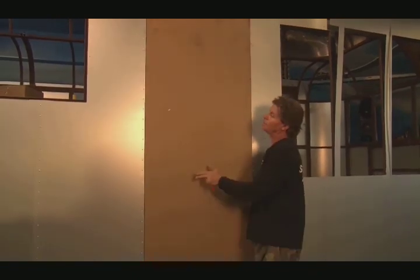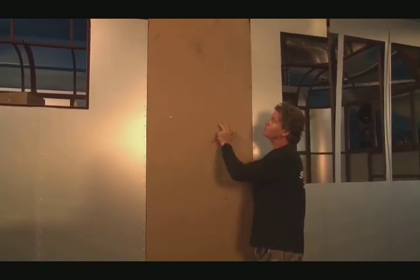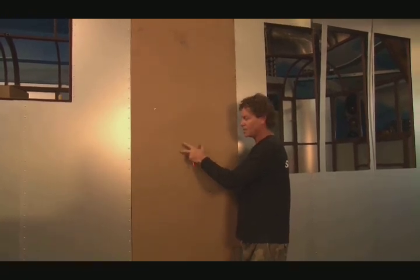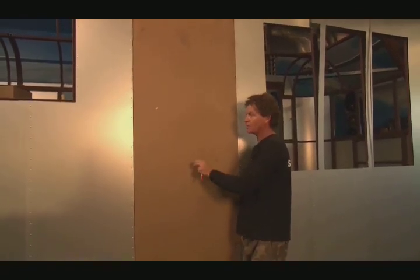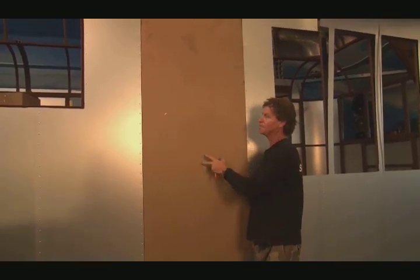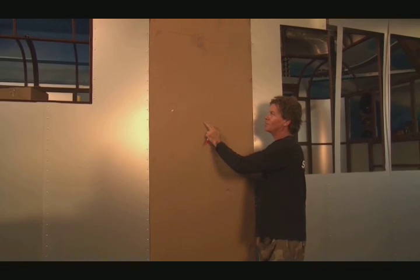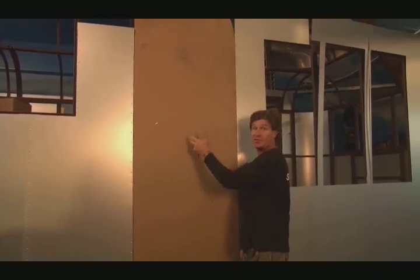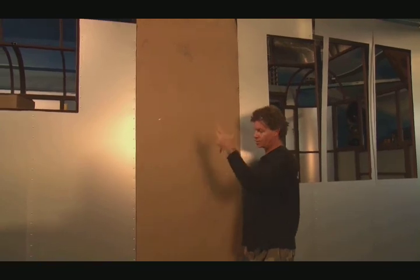With the gullwing there are some obvious clearance challenges. We're going to use a very light material — a fiberglass Nomex, kind of like a Kevlar honeycomb material — and then this will eventually be the aluminum skin. Before we put the Nomex down, we create a buck and make a template out of cardboard, which is what you're seeing right now.